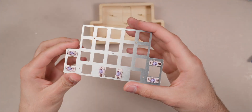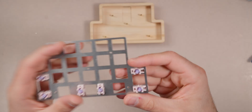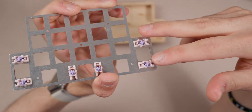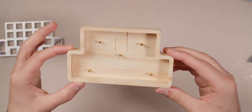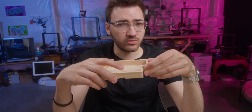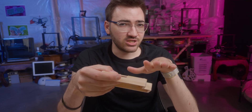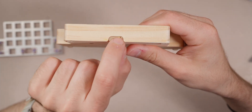Here is what I'm calling the premium Scotto Frog. The main premium part is this 6061 aluminum plate, 1.5mm thick, which I milled on the CNC machine — took about an hour. It has stabilizers installed, cheap ones from AliExpress, but they feel pretty good and don't bind. The case is yellow pine, which looks really nice. It has standoffs in the bottom, a recess for the Pro Micro, rubber feet on the back, and screws. There is a small blemish from a CNC collision, but it's minor.